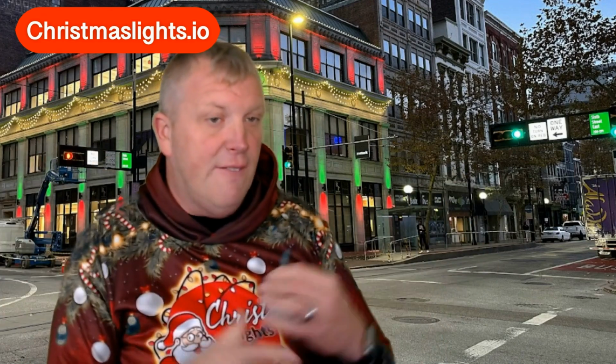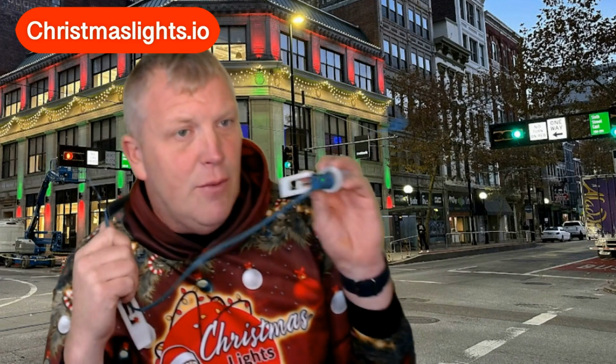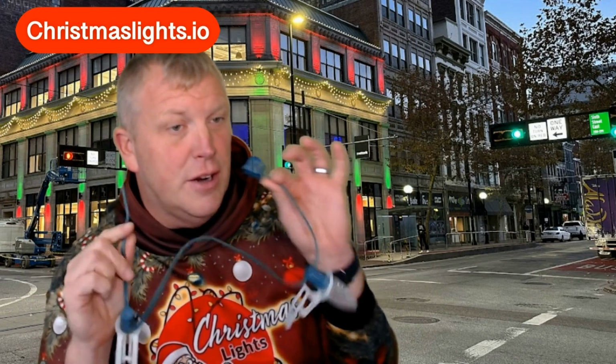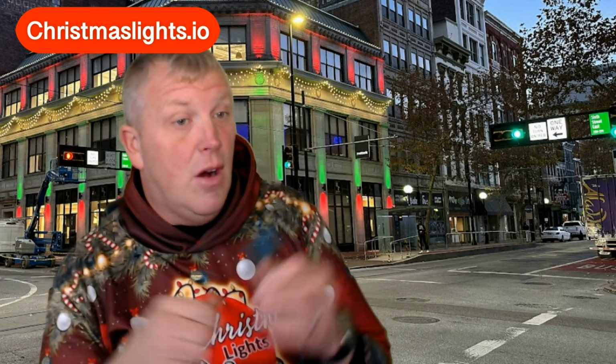Every time that thing pops, it does get weaker, so you don't want to just keep tripping and tripping, because eventually it's going to keep tripping. And those GFCIs do need to be replaced by an electrician if they go bad. And yes, sometimes they'll go bad. So when they go bad, I'll run my wire and plug it in a different one to help keep that from having any issues. So those are some things to think about with GFCIs and how to make sure your Christmas lights keep working all year long.